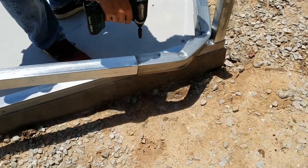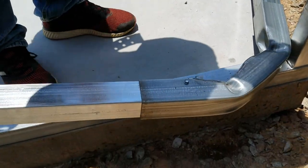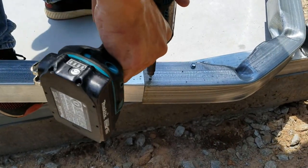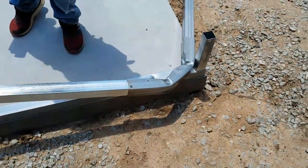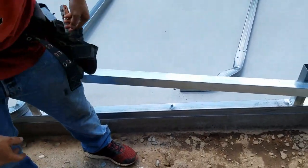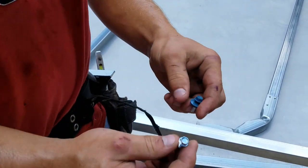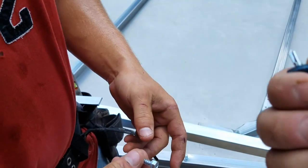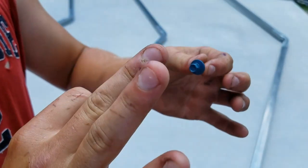This top corner. If you hear that second round, then you know you got it. It's all well, yeah. Self-tapping screws. You don't mind a little color here and there, do you? There we go. Love the washer, that's what we do. You got it in the pocket. More screws. Oh, another screw? Yeah. We got these and those. These are framers. These are ones that's going to be going on your roof. But this is just blue. So that rubber washer keeps the water from coming in. Yeah, and that metal flattens down and flattens that washer out.